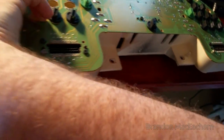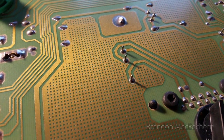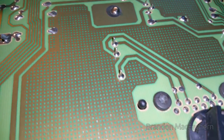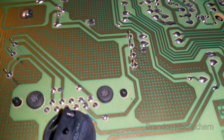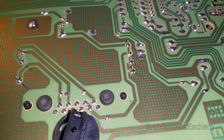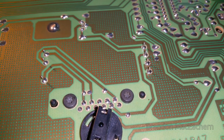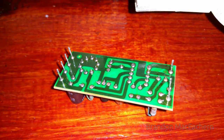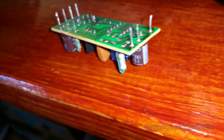Because it's a daughter board, you can check the pins here on this side at least. It does look like there could potentially be some cold solder joints on all of the pins. Now, I'm just looking through the screen on my phone, so I'm not exactly certain if that is what I'm seeing. But let's desolder it and check the actual board itself too, since this may be the potential point of failure. There's definitely some cracked solder joints on those pins - some a little bit more noticeable than others. There's some problems with those pins - they don't look that good.